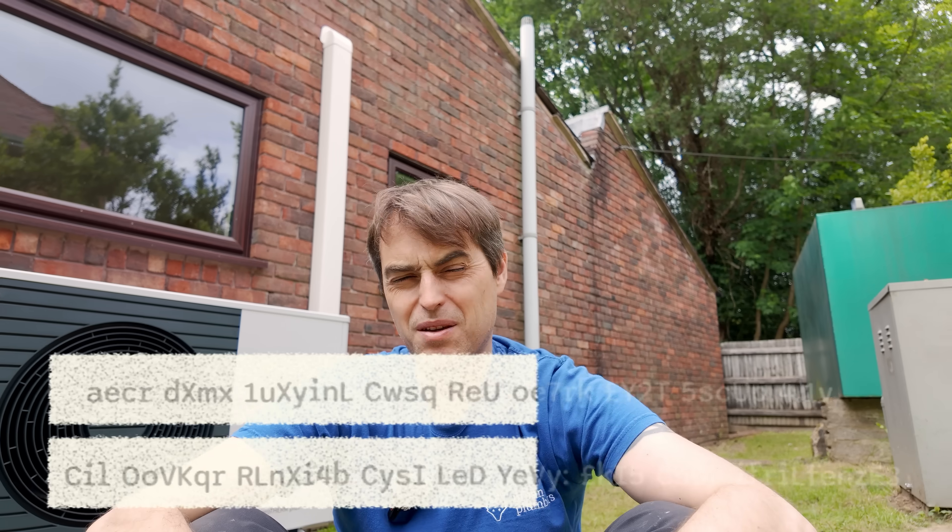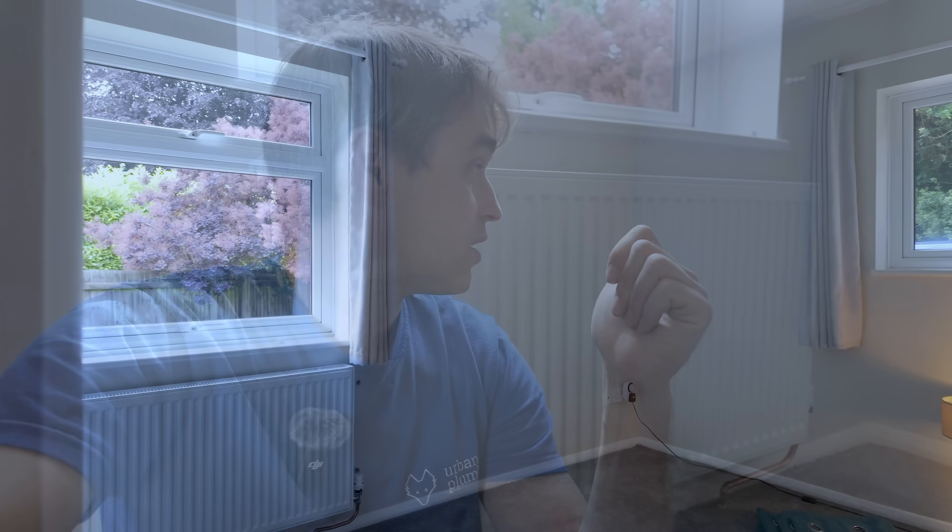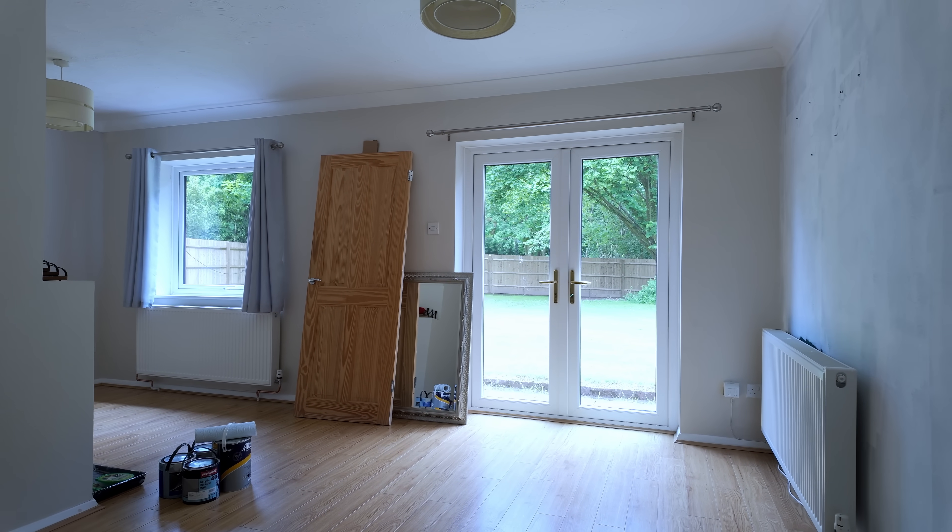We know it's quieter, we know it's cheaper to run, and look at how problematic this oil setup must have been — imagine taking deliveries of oil, the pollution in this beautiful area, having to smell the fumes from an oil boiler. It's incomparable how much better a well designed and installed air source heat pump system is to any oil boiler. In the bedrooms we've got one double panel radiator 1200 by 500, and in the living room we've got two double panel K2 radiators of the same size. All of those radiators will run at a maximum flow of 40 degrees.